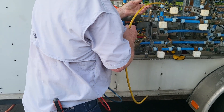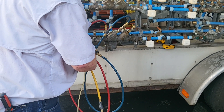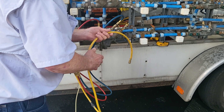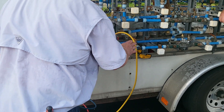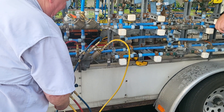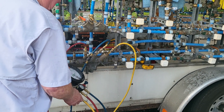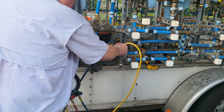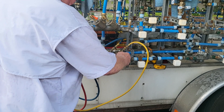My bypass hose up to my gauge, and loosely open testcock number four. Open my bypass valve, close my bypass valve, tighten the nut on the testcock.